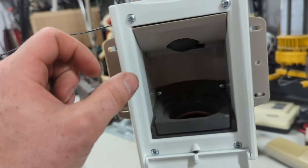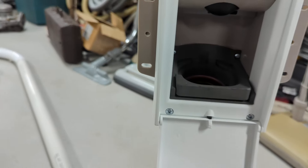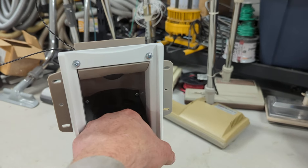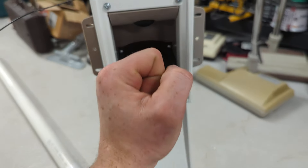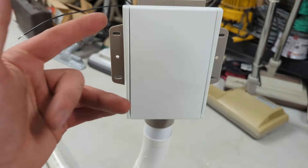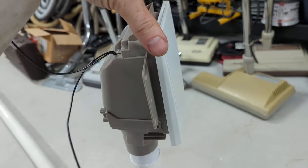To activate the system on a Chameleon, the switch is back here, so you turn it on. Once you know where it is, it's fine. You do your vacuuming, and when you're finished, you take the end of the hose and give it a little twist, which disengages the hose end from those pins and allows the hose to be drawn back into the piping. At the end, you push the hose and it bumps the switch into the off position, then you close your door. The rough-in is the box with the guts; the finish is just the door.